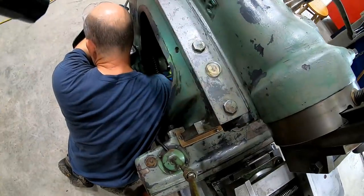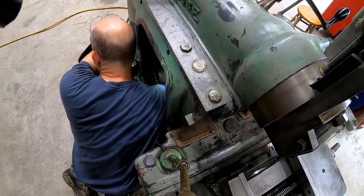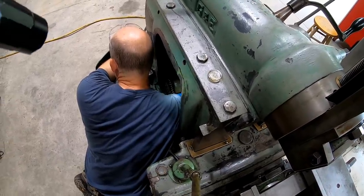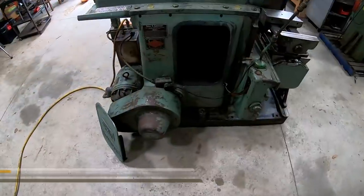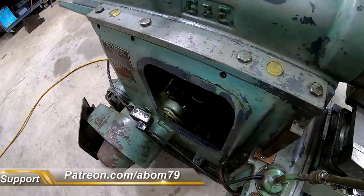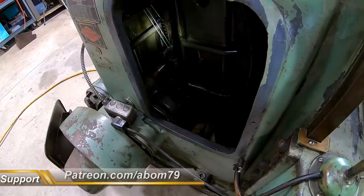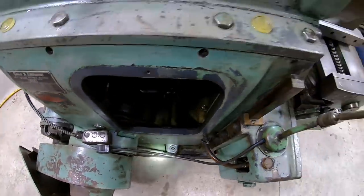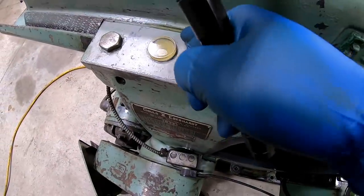Okay. Lance is making a little adjustment on the filter pickup down there. We think it's sucking some air. He's trying to do a little tweak on it, see if we can improve this oil pumping here. That made all the difference. He was able to tighten that fitting up there for the pickup, and now we're not pumping air. So all that air will start working itself out, and we're getting lots of oil up here now. You can see it coming up.